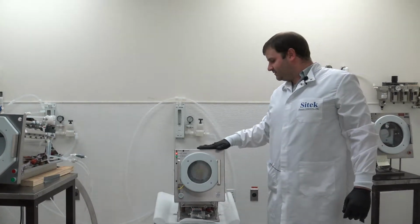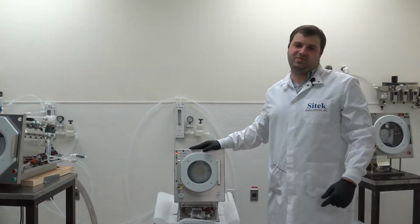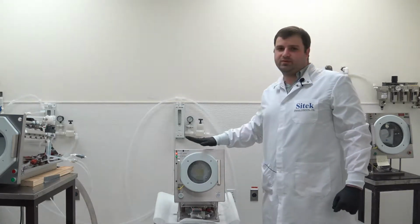We're in our rinse. This will be at low RPMs for our dry one. We'll ramp up to high and come back down in speed for our dry two to let our heater cartridge, N2 heater, do the majority of the work.